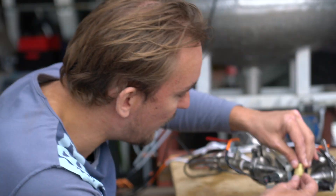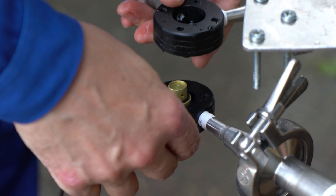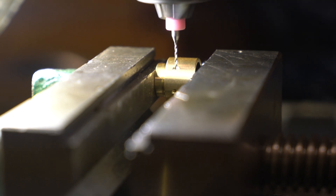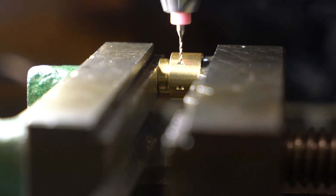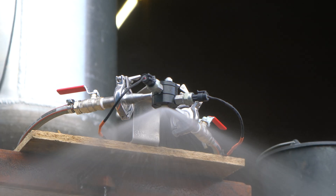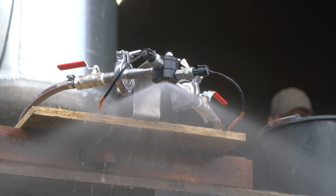Here in this manifold, the element sits approximately like this, and on the top side we feed it with water on the oxidizer side through the holes that we drilled, and then we can measure the flow rate at different pressures. We can also remove this tube to look at the spray angle of the element, which tells us how well we atomize our propellants.